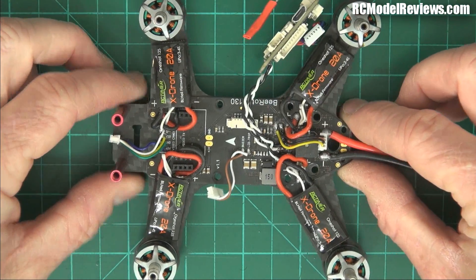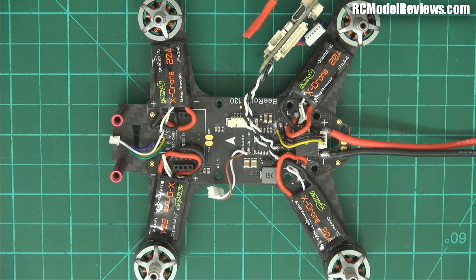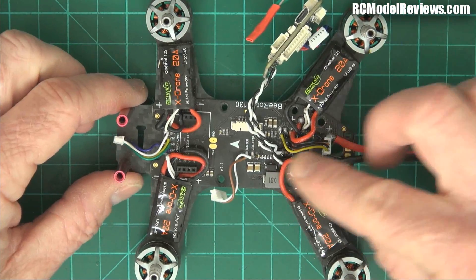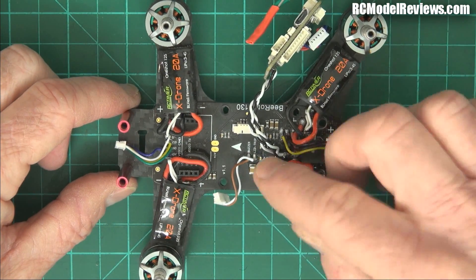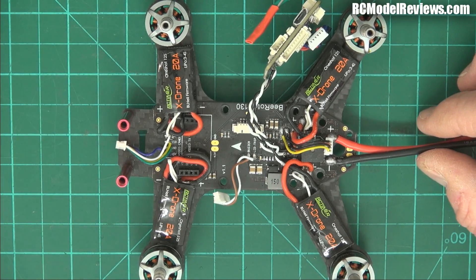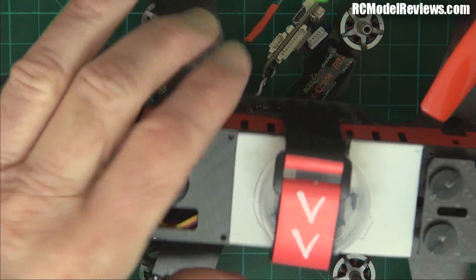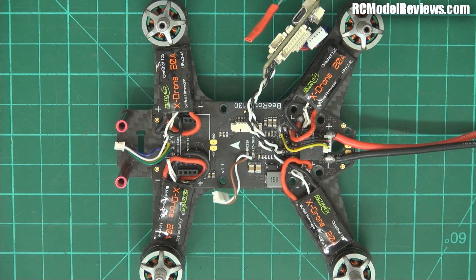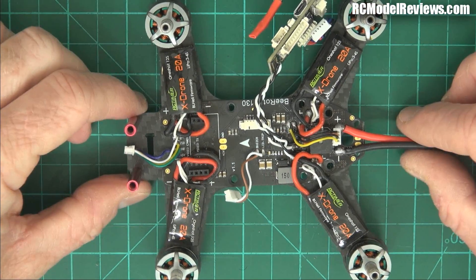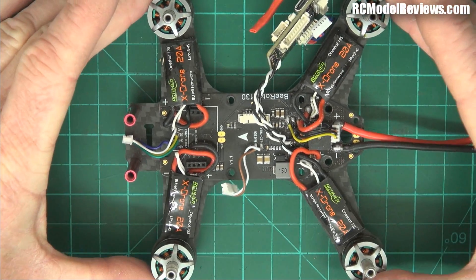They all seem to have it — they're just trying to be too clever. I wish they'd pay attention to basic electronic engineering: if you have two wires running next to each other and one carries a lot of current, the other wire is going to pick up a lot of noise, and there's nothing you can do about it. The DYS people were aware of it — they've got some large capacitors in there to try to smooth out the noise — but you can only mitigate it so much. Good layout and good design is what you really need to avoid it happening in the first place.